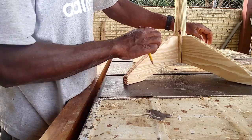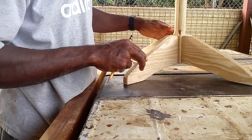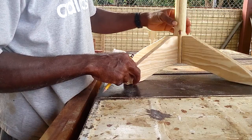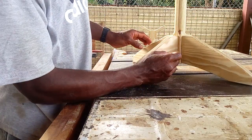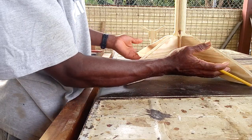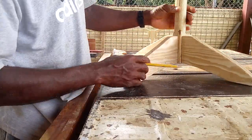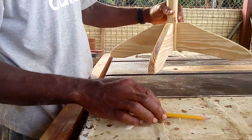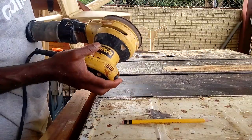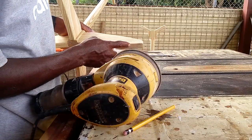I always try to make sure these two legs are square to the piece, meaning the piece is standing up straight. Because the floor wasn't level it kind of pushed it up and it's open here. What I would do next is use a palm sander and just sand until I get the pencil lines out, then test it again.